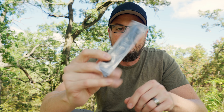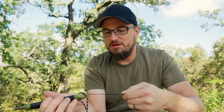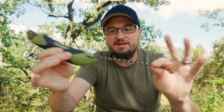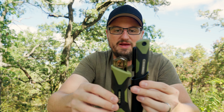Here's that replacement blade. It's super easy to replace — all you've got to do is loosen the clutch, pop it out the back, pop the new blade in, hook the blade back in, tighten the clutch back down, and you're ready to go. Literally under a minute to change the blade out, and you can basically rebuild the saw for $16. They've also got a shock cord lanyard on it so you can put that around your wrist and keep control of the tool while you're sawing. It's about 11¼ inches long when fully extended and just under 7¼ inches when you retract the blade.